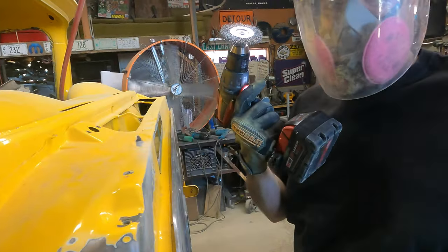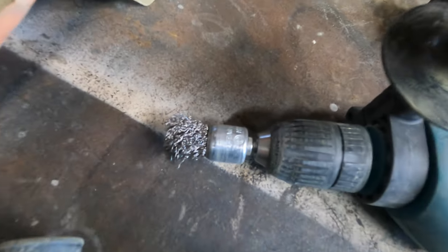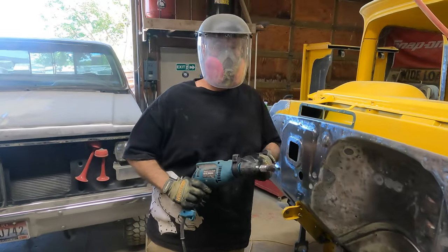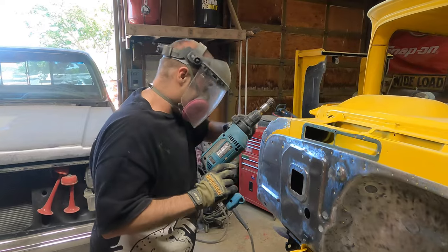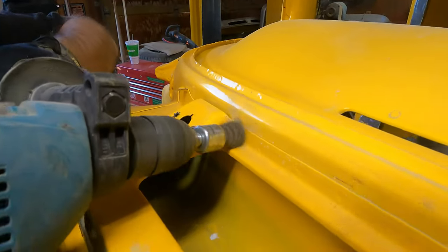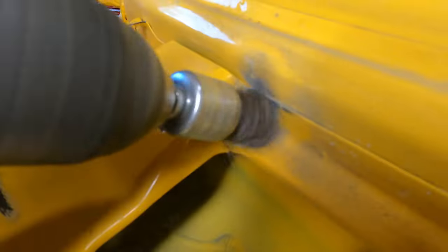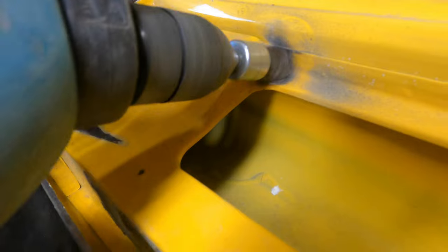It definitely has its purpose. I use a Makita corded drill — I have another wire brush. This brush is more aimed for corners, which it does work really good. Now one thing I love is the handle on this drill. It does take some pressure and in certain directions to have that wire brush really get that paint off. As you can see, this is a very hard to get to corner, and this is making easy work of removing the paint out of that corner.